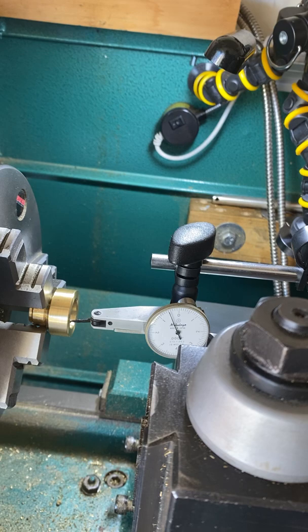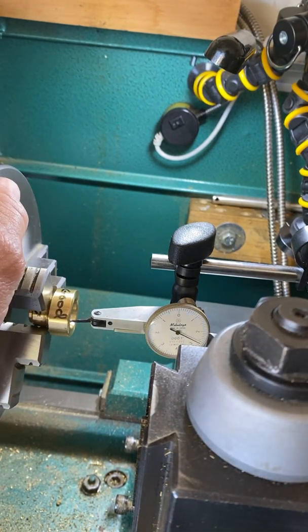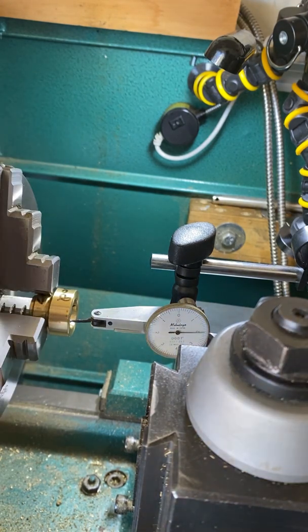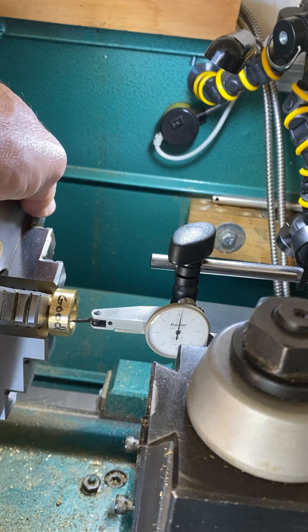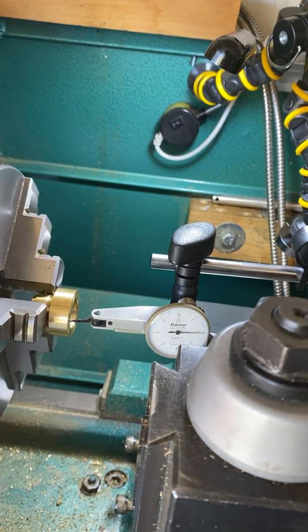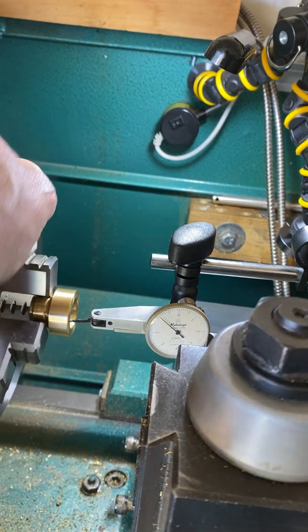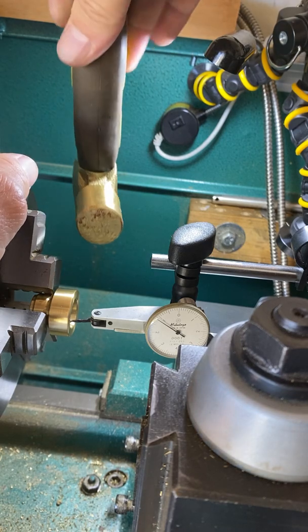I'm going to adjust this position to zero so I can see a little better. Now I'm two thousandths off, which isn't too bad, but I want to get it really great. So I'll take out half of that, and now I'm less than one thousandth off. I'll adjust this to zero again. By the way, the big numbers are one thousandth and the little clicks are one ten-thousandth. The general rule is if you get it to one thousandth you're good. I can see the variation going from about a half thousandth — I'm going to go to this end and take half of that away.